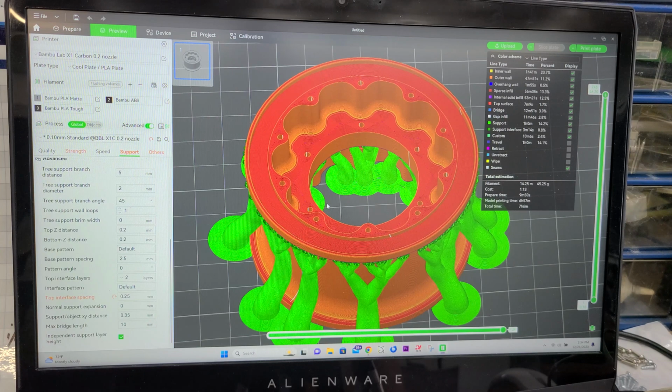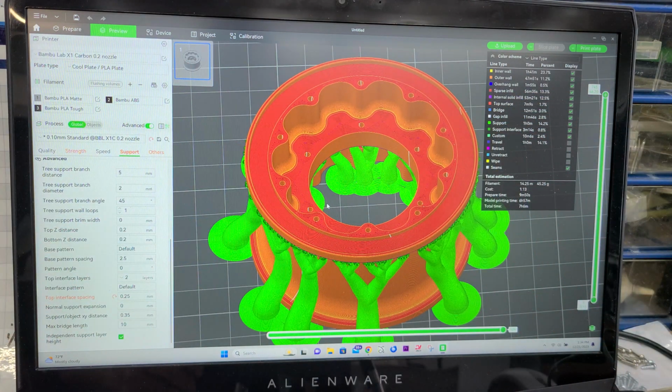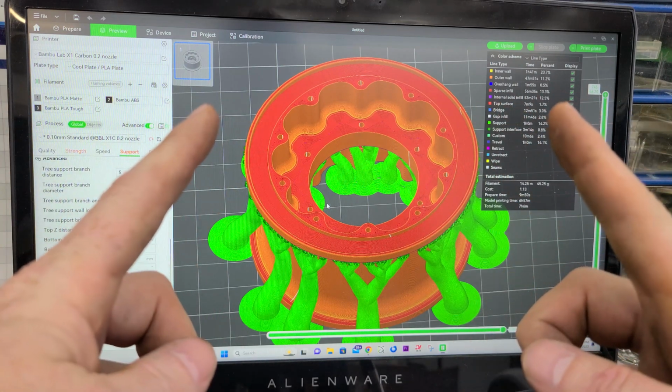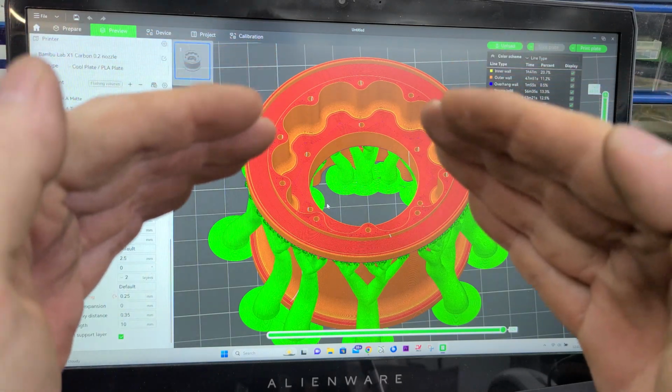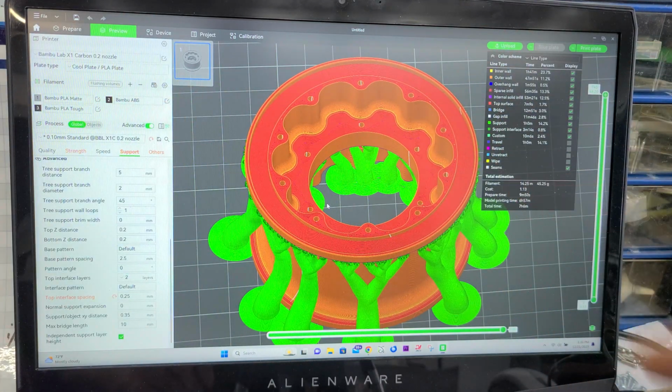It's looking good. What I've done is I've made the dish deeper because my car has narrowed control arms, so now I can dish the wheels out. So I'm reducing the weight of the axles and bringing all the weight more central to the car, and I can use these extremely lightweight wheels to widen the patch of the tire and also create more stability on the top end. With the tire stretched out wide, the tire doesn't want to roll and get that yaw of the car going. So that's the idea there. That's all we're working on: a little bit of 3D printing in the background, and sharpening some lawnmower blades for a big lawnmower.